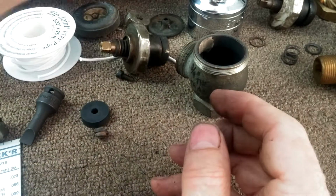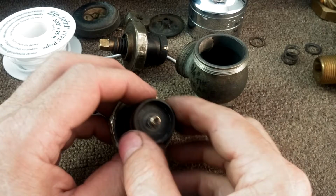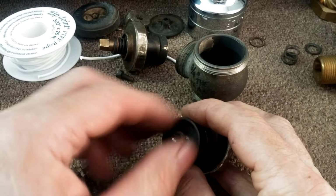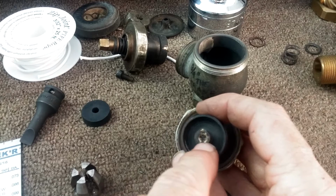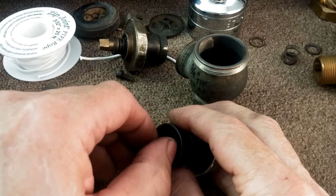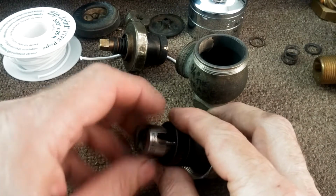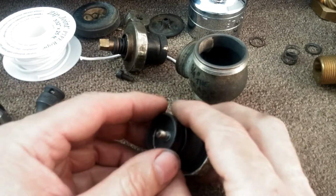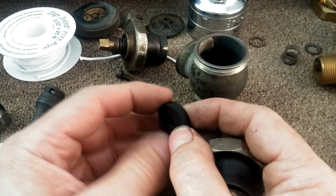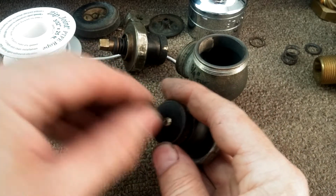You can break this down. I have an older one here. This is the one where the screw shattered, with the bolt, the bolt shattered. What they usually do is they put this on and then they stake that. And you see the dimples there where they've struck it so that it doesn't come off easily. When it comes off, you may have to run a die down there to rethread it. This is again 12/28. You can use a rubber 1-inch EPDM rubber disc, which will then fit in there more or less snugly, and then you can run that down to rebuild this.